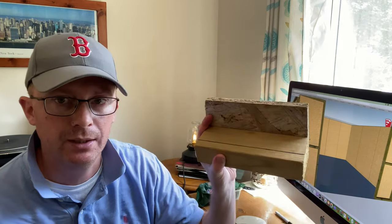And then the insulation, the Kingspan itself, or whatever I can get my hands on, the same stuff, will have to go in after. Now, the issue that then arises is this. I will be fitting it in, and the foil side will be up against the OSB. But I won't be able to use the aluminium foil to secure it to the inside of the wood. Now, I've seen this on numerous garden room builds, that provides an extra barrier for moisture leaving and escaping, and has that got a potential for it to cause rot in the structure.